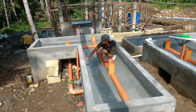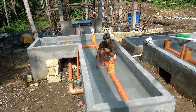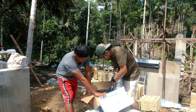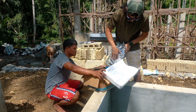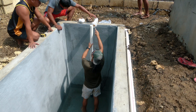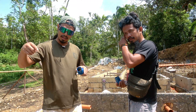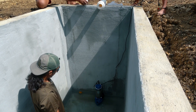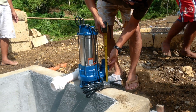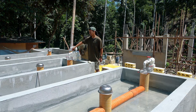This first planter is pretty much complete on the inside. We'll paint it and make it look nice, but we wanted to reach this point so we can start cycling the water. As for pumps, we're not using aquarium pumps — we're using sewage pumps. The pressure needed to be strong, and if anything got caught in them the blades would cut it up, so even if a fish got caught it wouldn't jam the system. They were readily available, cost-effective, provided enough head pressure, and can stand everyday use while being easy to repair locally.